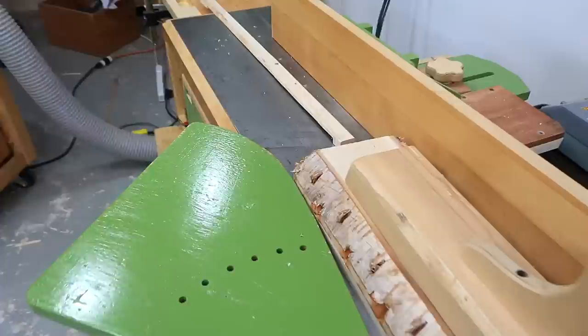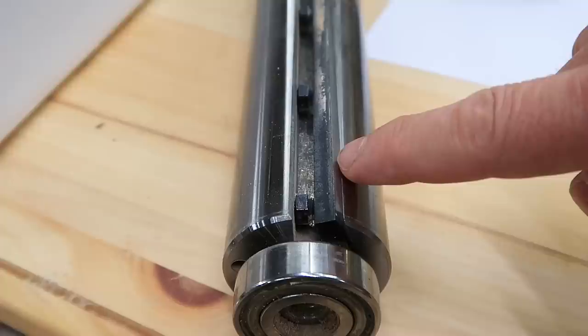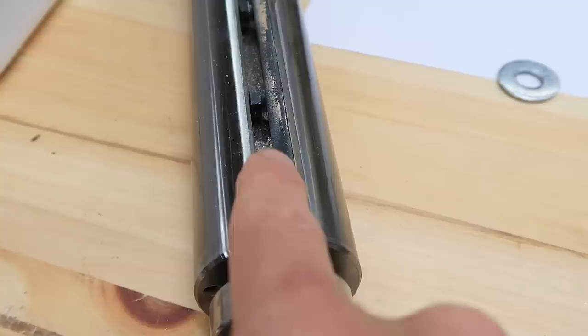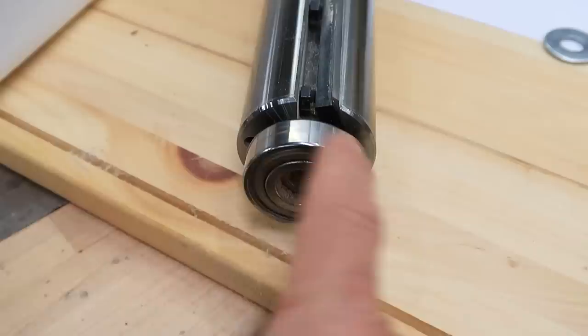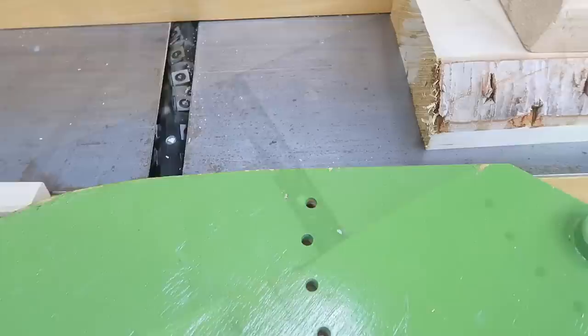I've been doing most of my tests by pulling the piece through with a winch, but if I push the piece through manually I really have to push hard — because those scraping inserts really push back hard against the workpiece. Those little divots from chips getting caught on top of the knives were probably made a lot worse by setting the knives really low, which was an effort to make it quieter but just doesn't give enough room for the chips. If I end up putting this head back in I'll set the knives a millimeter higher. I also need to re-grease those bearings, and if I keep this head I have to do something about balancing it because it sounds like something's about to explode — or maybe it's the bearings. I just don't like the sound of this.